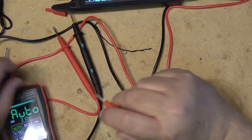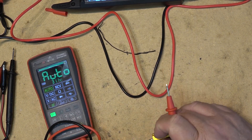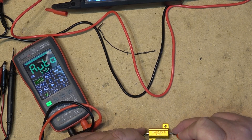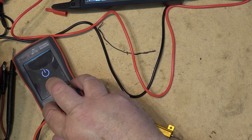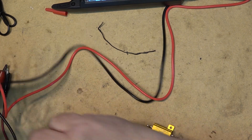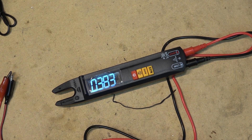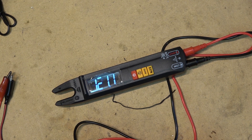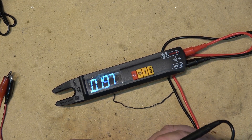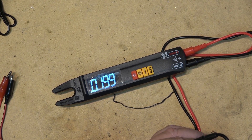Next I have a 200 ohm resistor. Let's measure the resistance using the conventional meter here — make sure it's actually 200 ohms. It's measuring 202, 201.9. We know that's 200 ohms. Let's check it on this meter — the 200 ohm resistor should measure 201 ohms. I've got a bit of oxidation on the leads. So 200 ohms — close enough.